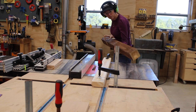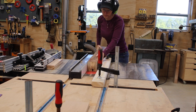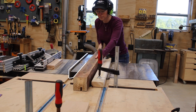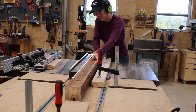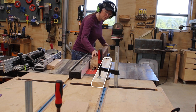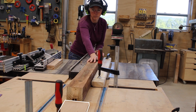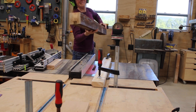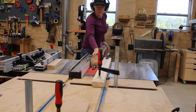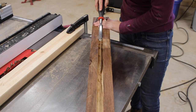These channels are what make the front slots adjustable. To cut them in I go to the table saw, and the trick for cutting in a channel easily is to set up two fences. You make a first pass using the table saw fence which is set up to establish the far right boundary. Then on the second pass I use a scrap straight board aligned to the left. Another scrap is placed on the outfeed table to establish the depth of the channel. On the third pass I don't use either fence but instead float my 4x4 in between the two to clear out as much of the center as I can.